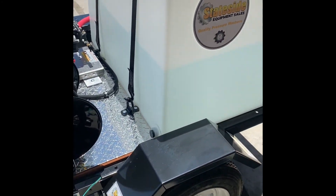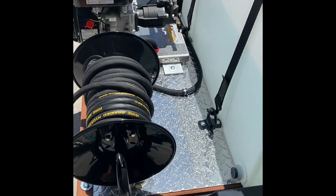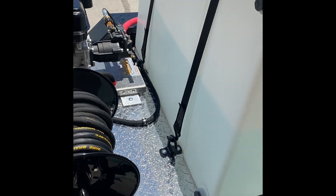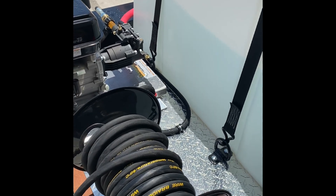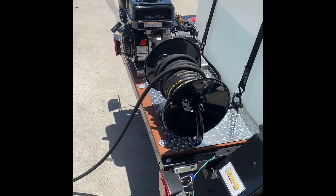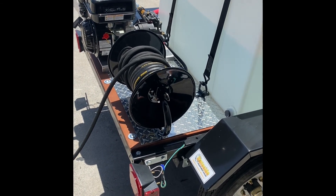Starting it back up — it could take up to 25 to 30 seconds to start pumping water. And there we go, it's all purged and ready to go. This answers the question: how do I get a pressure washer to run off a tank? Most people think their pressure washers are defective. Gravity plays a huge role — once the water gets there, the pump will prime and pick up the water, but it won't pull from a tank on its own. You don't need an electric pump in between; that's a fire hazard. You just need to properly purge the air. Check us out on Instagram or stop by one of our stores — we're glad to help and we can help you purge the system too. Thanks so much and have a great day!